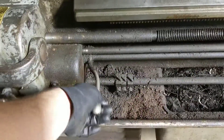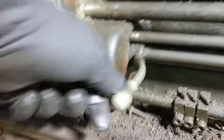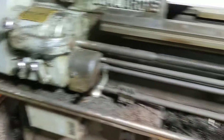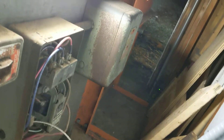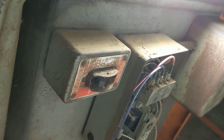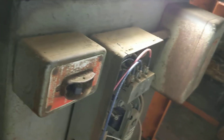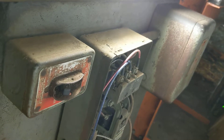This is the on-off switch down here. You hear that relay? There's a big switch here that's operated via this rod — you can see the rod that comes through to actuate that drum switch. This thing is so cool, it has an electronic brake on it. You see that big box over there? That's a Warner Electric brake. Then this switch right here, that's for the tailstock coolant pump — this machine has flood coolant. And then the breaker in the middle there.